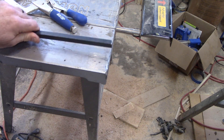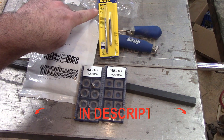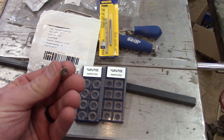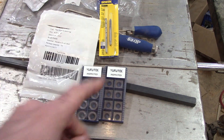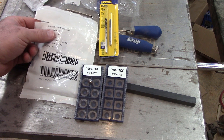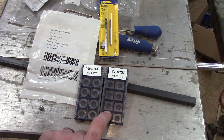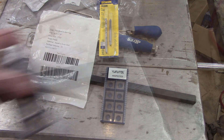Now here comes a very precise part. Let's go over the hardware. I've got an 8-32 NC drill and tap set right here. And then we have our 8-32 flat head socket cap screws - they're stainless steel. They've got a taper on the head so that way they'll fit in these carbide sets. They are 3/8 of an inch long. I'll link all this in the description below. And then I've got two different types of carbide tools - the round ones and the square ones. Wherever I put this on the edge, I should be able to interchange them if I want to.